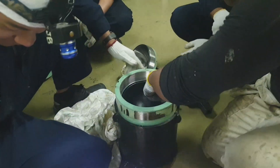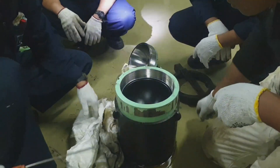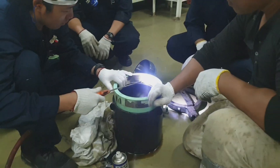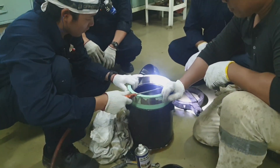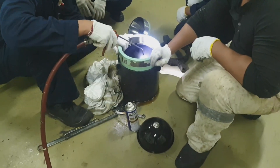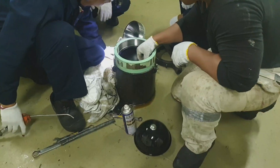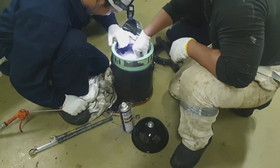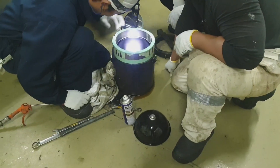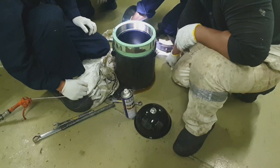Check carefully that the backup ring sits properly against the membrane. It should be cleaned properly — that is the very important thing to consider when overhauling any machinery. Now it is already installed and the next step is to install the other half of the accumulator assembly.